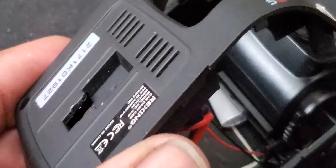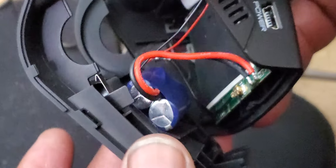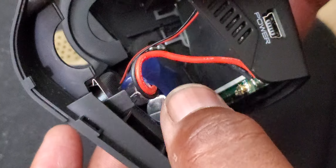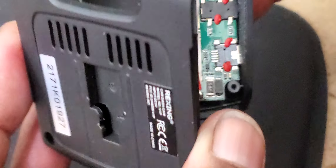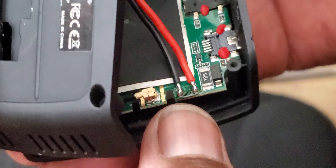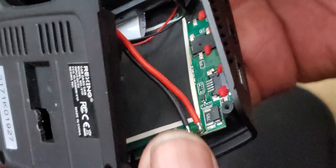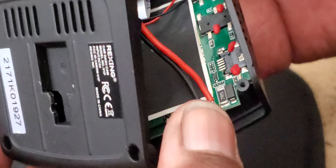Another thing that can be done is if you have the version with the battery and need to change it out, you want to just gently stretch the board out — be very careful with it. The battery would be in this area; this version remember has super capacitors. For the battery version, it mounts to the board easily and you can see a negative and positive lead for the battery, so you can desolder there and take it off and swap that battery.